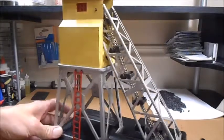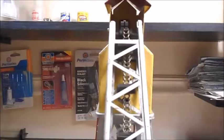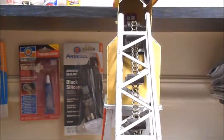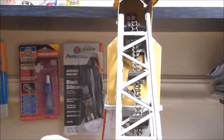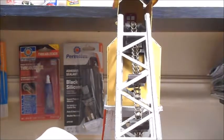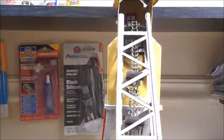Let me adjust this and zoom in a bit. If I tug on this chain at the top, there's a spring here and a spring on the other side. Both springs are pushing in on these tapered plastic pieces to keep the spring centered. If I tug on it you can see those pieces going out — this is the chain tensioner. It would be all the way in if it were as tight as it could go.